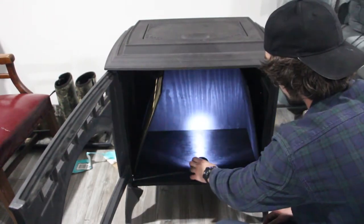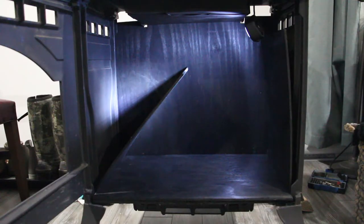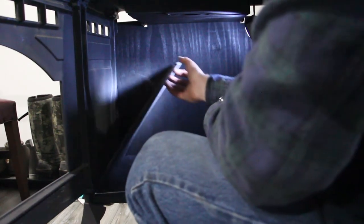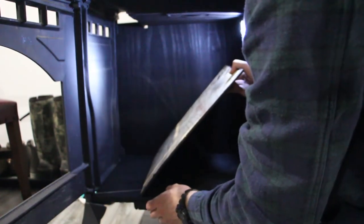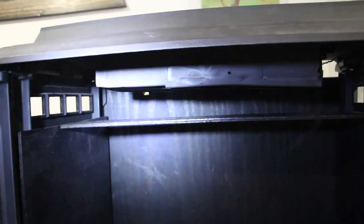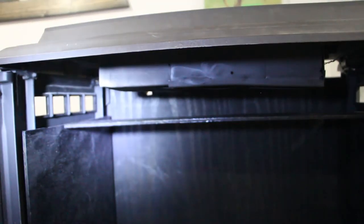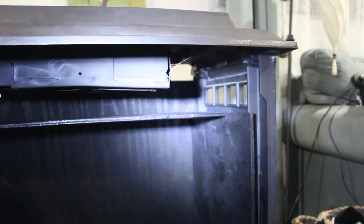Let's get the camera down at ground level so you can see that better. Down here at ground level, you've got your base. These two boards are wedged — you've got these columns over here, it runs all the way down. There's a little gap in there, and it slides in. Same thing on the other side. No need for nails, glue, nothing. Just wedged nicely on the top.